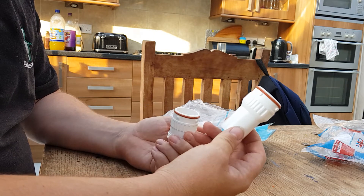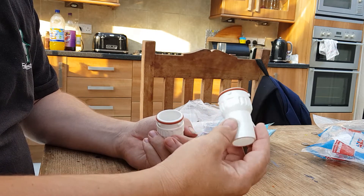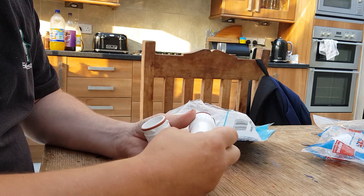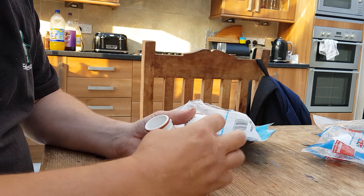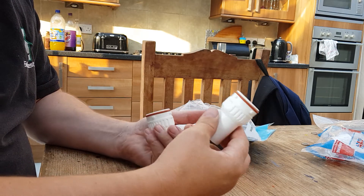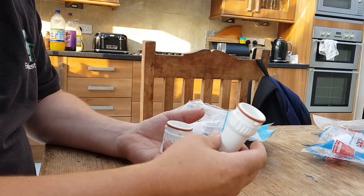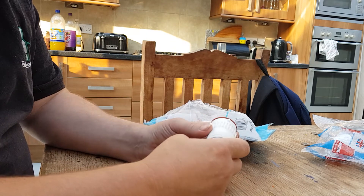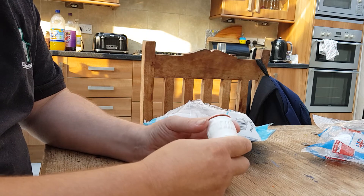This one we generally discard because it doesn't fit inside a UK push-fit or solvent weld fitting. You can play around with blow torches by heating up the 32mm pipe to squeeze it over, but for me that is not fully insured, so I have developed a solution to get from this fitting to UK fittings.